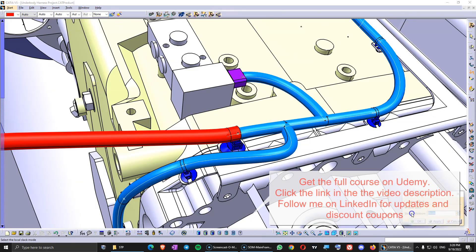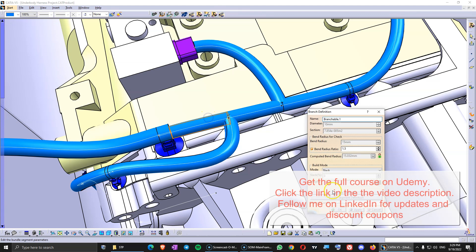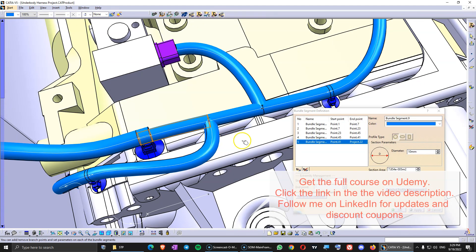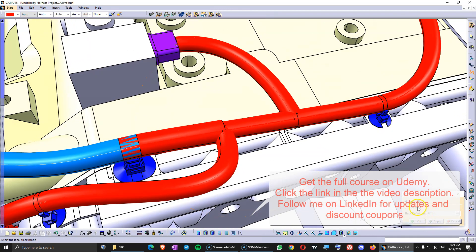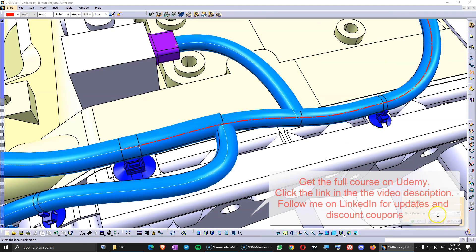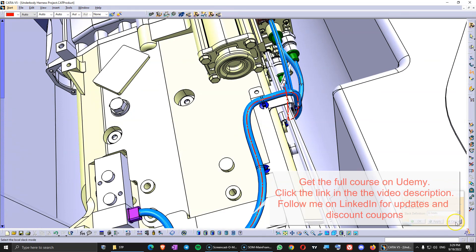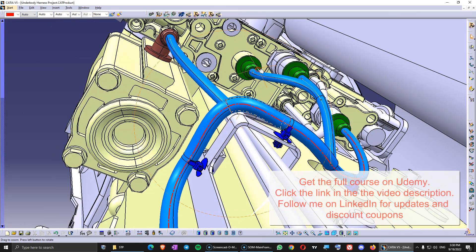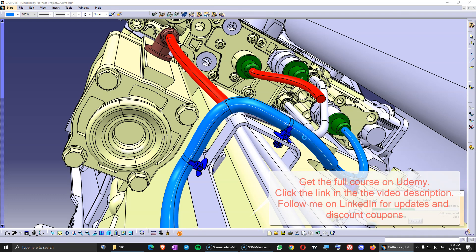Let's add some slack to this part. This bundle here is also going to be 12 because of the wires coming in. Let's give a very small slack here — 1 is too much, let's do 0.1. This is probably because we have the same bundle and it's bending here. But this is not a problem because it's the corrugated tube that makes it that thick. So if we do 1.4 here — okay, 1.4 should be fine.